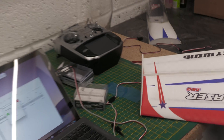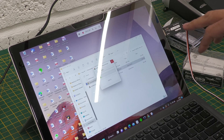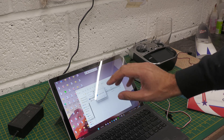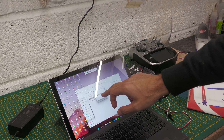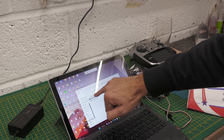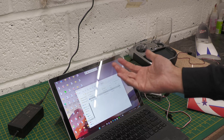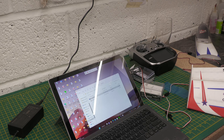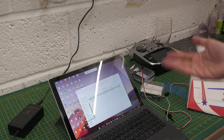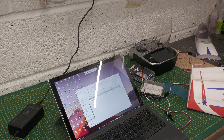The PC is saying 'not responding,' which is a little nerve-wracking, but I'm just going to leave it. The LED on the control unit has gone red, and the gyro lights are flickering — so it is doing something. If you see 'not responding' in the updater, just leave it, it's probably playing catch-up while writing data. The update then shows as successful. The updater wrote the binary file from the same folder — which is why you need to extract the zip file first. Took about 10-15 seconds. Don't pull the cable or power while it's writing, or you'll corrupt the gyro.